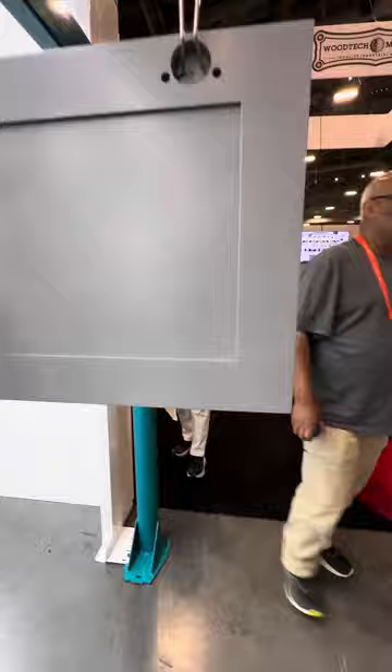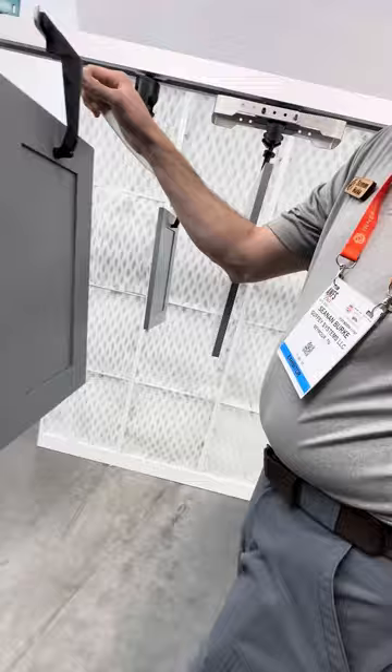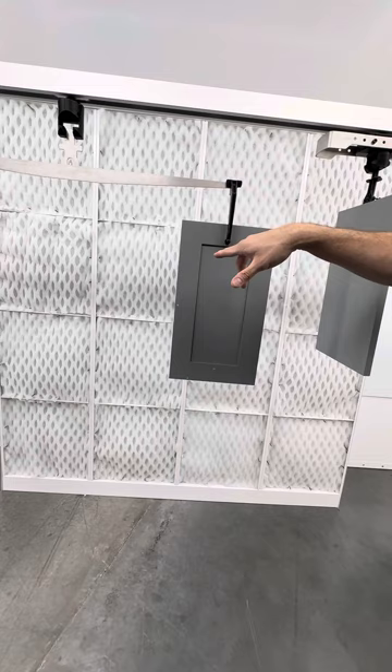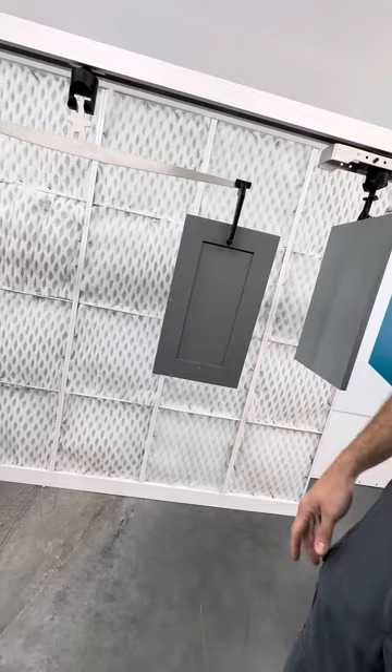These kind of look like they're designed for cabinetry — exactly. So this is an EFC clip, like a Euro finishing clip. It's for the pre-drilled hinge pockets — that's how you drill your hinges before you spray, and that's how we hang them. If you were to drill your hinge pockets after you finish, you'll use this type of hanger and just put them where your hinge is going to go. This is also what we use for drawer fronts — it will leave a little hole and a little unfinished spot, but it's going to be covered up by your drawer box.